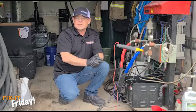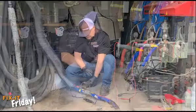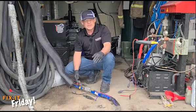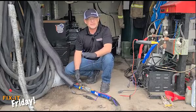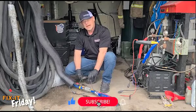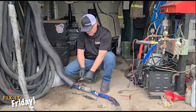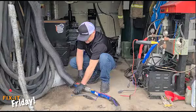In this case, we're going to test on the other end and see what happens. We've exposed the whip end. This is where the TSU is located on this system. Typically the TSU is located at the whip, but most interior insulator applicators — guys doing coatings or roofing — sometimes have it set further back. The TSU isn't critical at this point because we are still testing the heating side of the system, not the sensing side. So we want to test our whip with the machine still off.